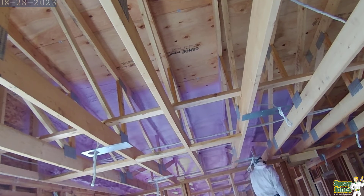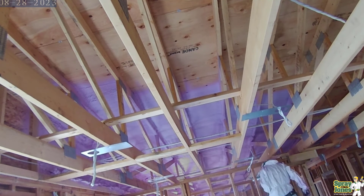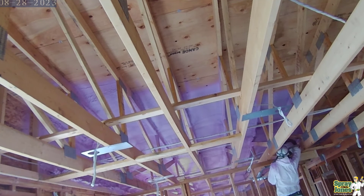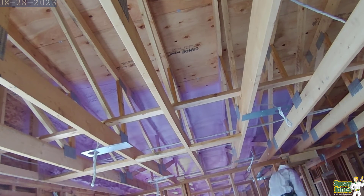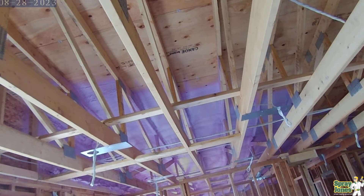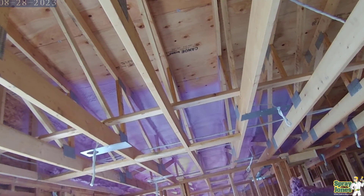We've sprayed two, three, and four inches of closed cell foam in roofs. I've gotten through the nastiest Saskatchewan winters with two inches of foam in a roof on retrofits for garages and all sorts of different things. I've gone with three inches for years and four inches where we have the ability to do whatever we want but wanted to stop at a certain financial point. It's a very good system — it works when everything goes well and when you've installed it properly. Even when you haven't done your job effectively, it's not a total and utter failure the way some people want to make foam out to be the boogeyman.